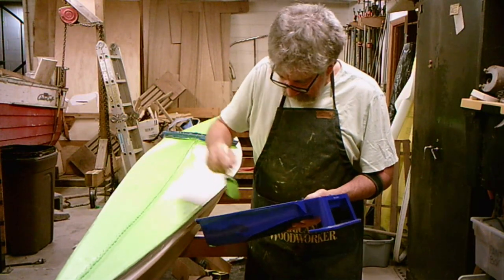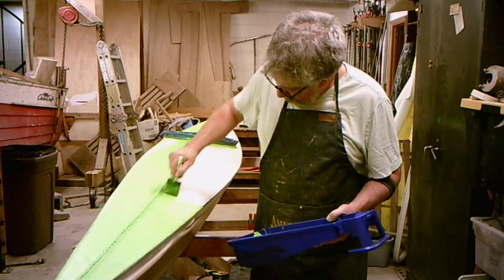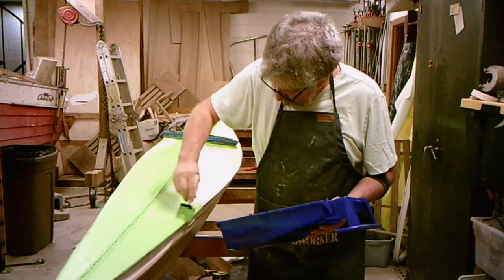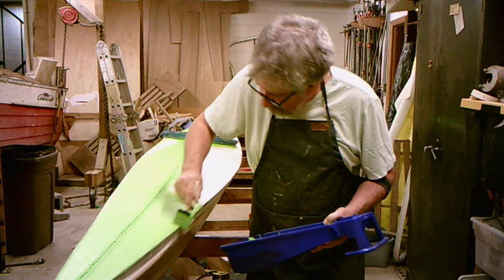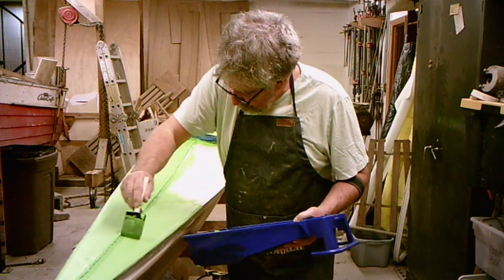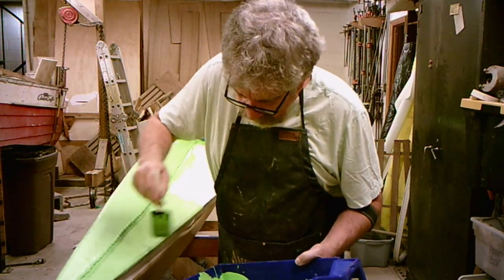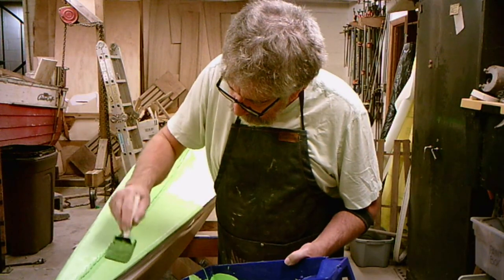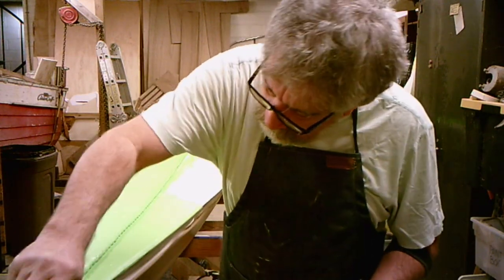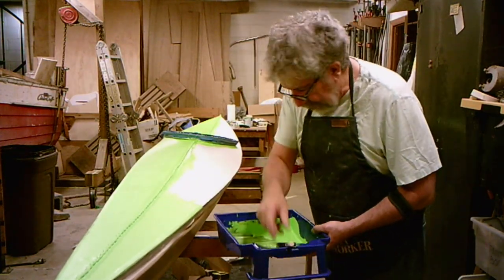This works great because this paint is so thick. I can put it on there, it lays on the top, and then I can spread it around. I can bear down a little, it's not leaving bristle marks. I'll just have to look back and go over it. Because it is thick, you've got to make sure to get it even. There's a spot I missed. So, go back, give it a minute to dry, and I can see sometimes where I didn't get it real even. But this just works better than rollers. If you're doing one in latex, I'd say skip the roller.